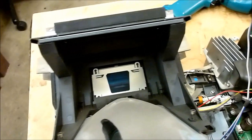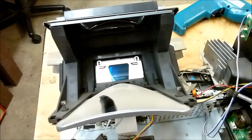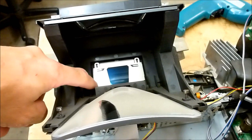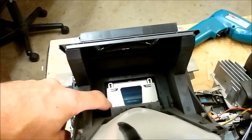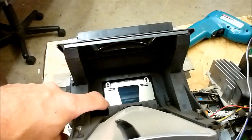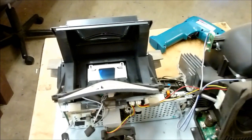And if you're very careful about it, everything's great. But if you, like I always like to use compressed air to blow the dust out of these sets. And it actually drives dust down inside here and gets it on the face of the DLP chip, and that can lead to little spots on the screen about the size of a silver dollar, about 2.5 inches in diameter, little blurry spots. People describe it as little baseballs on the screen a lot, or golf balls.